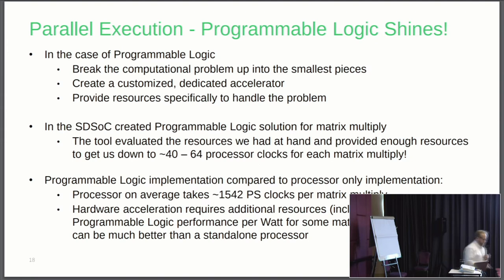The other thing is it is a completely separate processor — you could have the main CPU going off and doing other work in the meantime while this is doing the acceleration. So you actually get quite a bit of performance out of it. Since it's separate hardware, you could set up an elaborate scheme where you allow that one to go off, maybe it generates an interrupt when it's done, but in the meantime the processor can go off and perform some other work — it could be running your web server that's not really real-time sensitive.